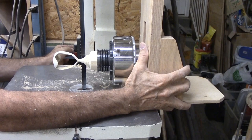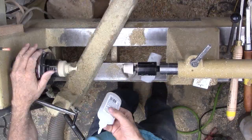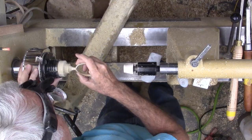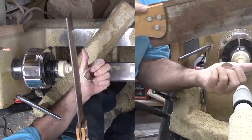I've decided to saw off the bumps on the front and back at the bandsaw. For safety, I leave the wood in the chuck but mount it to a saw jig. Despite going very slow, the pressure is too much and the heart breaks at the short grain. I decide to keep going — medium CA glue to the rescue. It was a clean break on both sides and I can probably get them to align very well. Since I did not get the bumps cut off, I'm grinding them off with my right angle tool with a rasp bit. It goes quickly. Then onto a lot of sanding, then cut off the heart with a saw. I'm not going to risk a parting cut here. Then more sanding with a pad and a drill chuck mounted to the lathe.